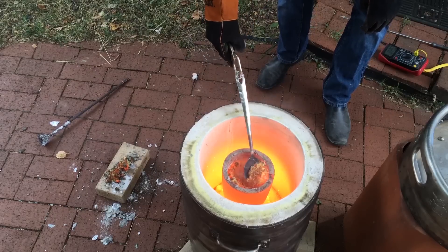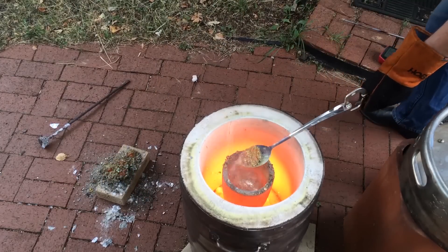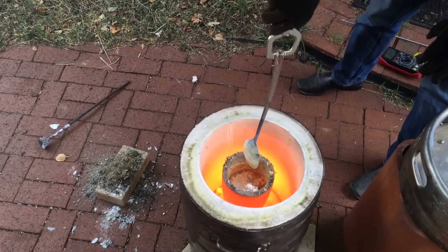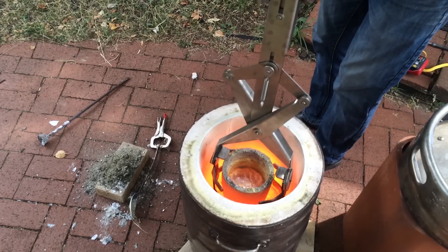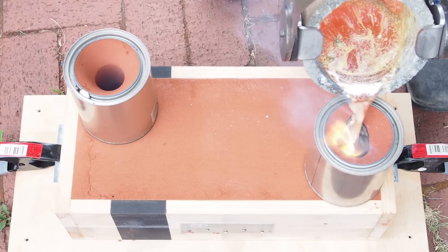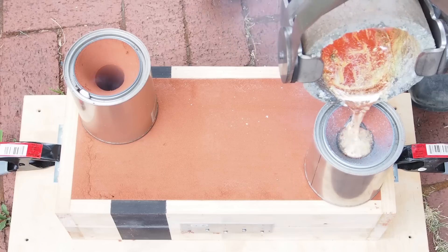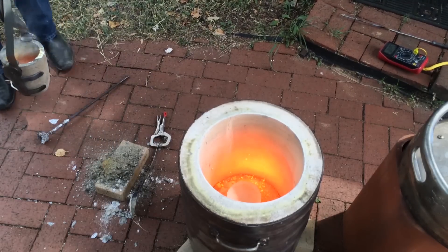You can see how much dross I ended up with. I didn't degas or use flux of any kind. At this point, I thought I'd probably had a bad cast since there was no brass in the riser. This is my first brass cast, so I might have needed the metal to be hotter. It probably would have helped to have the mold warmed up a bit as well.